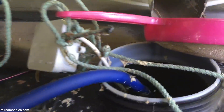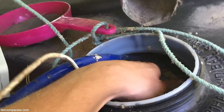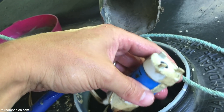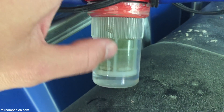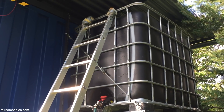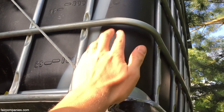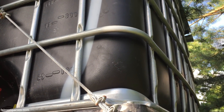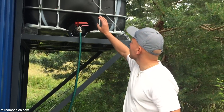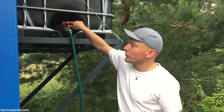This pipe goes to the water tank — it's a very DIY solution made from kitchen equipment, but it catches debris from trees and so on. Inside the water tank is a small pump I bought at a hardware store specializing in camper equipment. It's very small but it works. There's also another filter here that catches small particles so you can use rainwater in your bathroom and kitchen. The steel structure holding the tank must be very strong because the tank is currently full — it weighs 1 ton, 1000 liters. The pump moves the water inside the container, and you can also use this output for your garden.